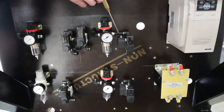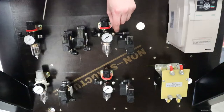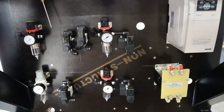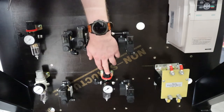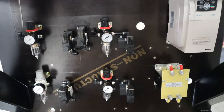So what I'm going to do next is go through and add the pneumatic tubes. You can see this one here is already in. Because it's such a tight distance between the two points, I'm going to cut the tube to size, put it in, remove this, put it in there, and then put the whole thing back together. Up here, these two both run on the same pressure so they share one regulator. Everything else runs on a different pressure, so they're all on different regs. It's a lot of regs and a lot of solenoids, but that's what you've got to do. I might even put a fourth or fifth solenoid down here later for other things. Now, I'm assuming you want to know what these solenoids are and what this pneumatic system does. This one here opens and closes the spindle. Between the rest of them, we have a purge air for when the ATC or tool holder is out, a sealing air for when the spindle's running, and then one set aside for an air blast system. That's what I've got here pneumatic-wise. Let's get it plumbed.